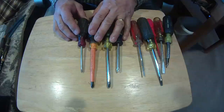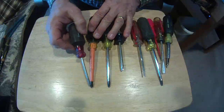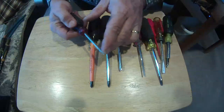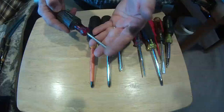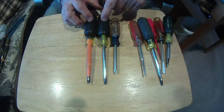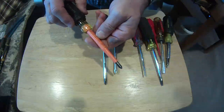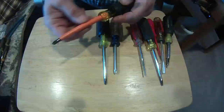Next — the biggest group here — is the Phillips. I've got four different Phillips here. This is a number one, these are number twos, and this is a number one — see how small it is. They go down to a zero and up to a three, and they number them so you know which one you're looking for. These three are number twos: I've got a Craftsman and two Kleins. This one here is a high-voltage screwdriver, good for a thousand volts. If you nick this, you'll actually see a different color underneath — that way you know it's been nicked.